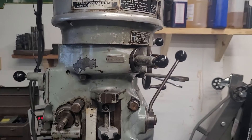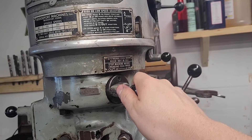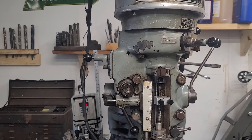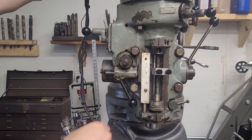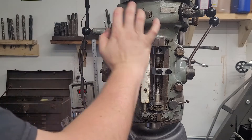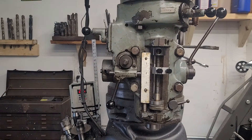Now to our next selector lever — to select power downfeed, disengage the feedworm when not in use. This is pretty important, you'll wear this out. Also, stop the machine before engaging the feedworm. Do not do this with the machine running or you'll have to rebuild your entire power downfeed — that is not a fun or pleasant proposition and it costs a lot of money. So with the machine running, this selects forward and reverse. Sometimes you've got to smack it with your palm a little bit — I like to keep pushing until it falls in place. Now we are feeding on its own.